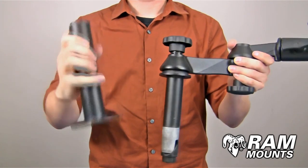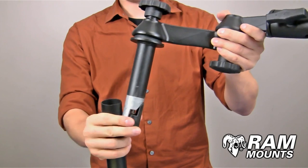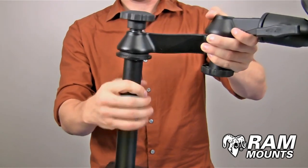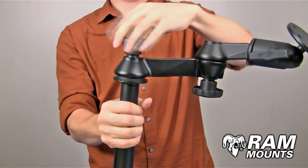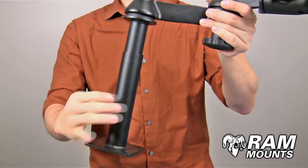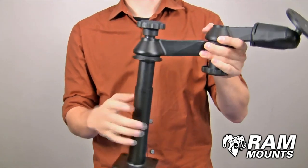You have a seven inch long lower pole and a four inch long upper pole which integrates to four inches of a two piece wedge assembly. By dropping the wedges into the female portion, you then tighten the knob directly above the pole. Tightening the knob forces the wedges to expand inside of the lower pole, securing it firmly in place for any rugged environment.